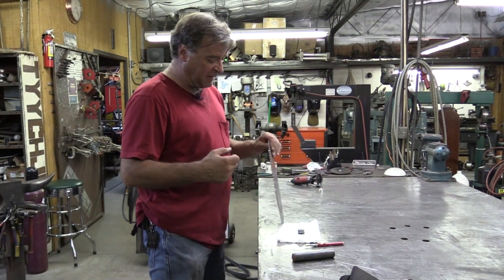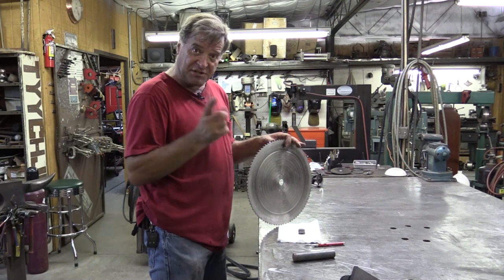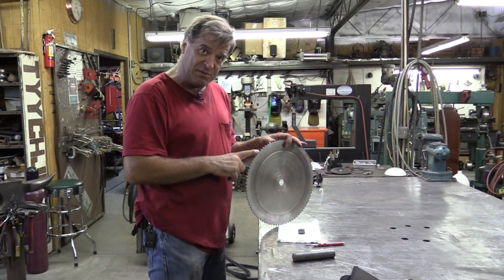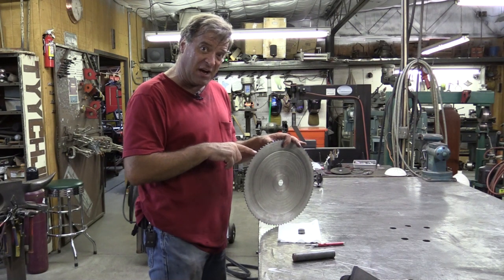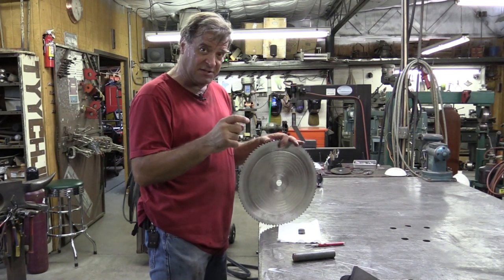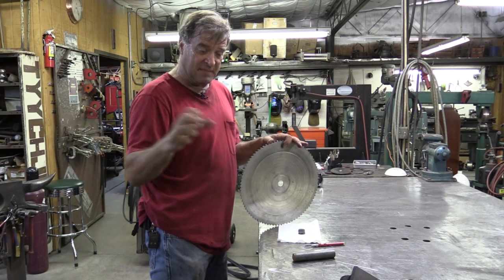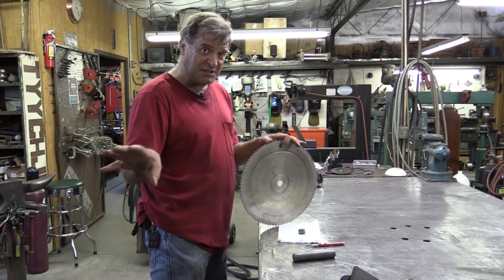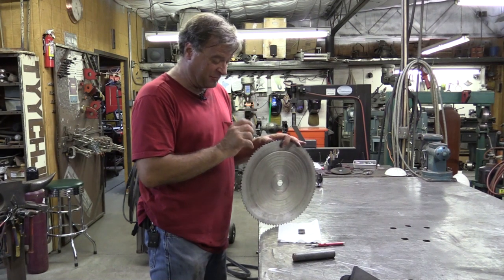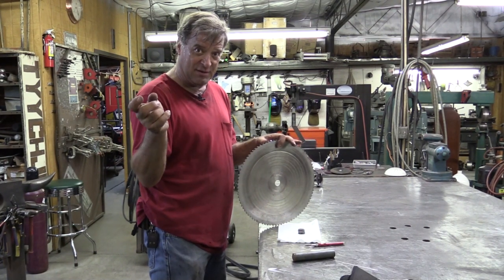These blades can run upwards of $200, $225, $240 each. The teeth on these are actually replaceable. When something pops out of the vise and you rip off a few teeth, expect to spend about $65 per tooth to have a new tooth welded on and reground — and that doesn't cover having the whole thing resharpened again, that's just that one tooth. So real good reason to go slow with hand pressure only and run a sharp blade. If you start seeing lots of sparks, stop and put a sharpened blade on. That way you don't rip teeth off and you don't run the chance of bending the blade, because when you bend it, you toss it and go buy a new one.